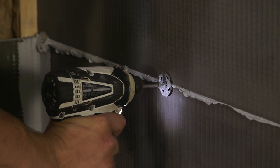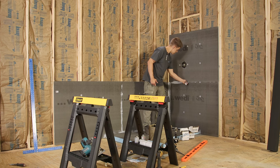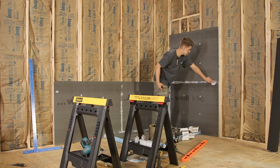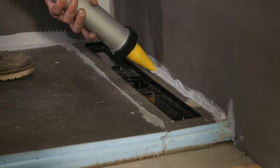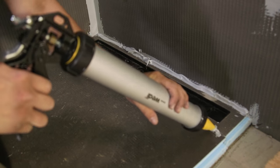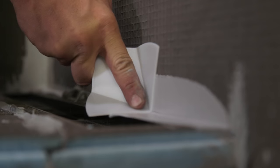Additional fasteners are set into seams between wall panels to create flush transitions. The washers will be sunk right below the Wedi building panel surface to make for a great flat surface to tile on. A final step to seal and reinforce the assembly is to apply another half inch bead of Wedi joint sealant over all seams. Use a Wedi putty knife to spread the sealant flat.